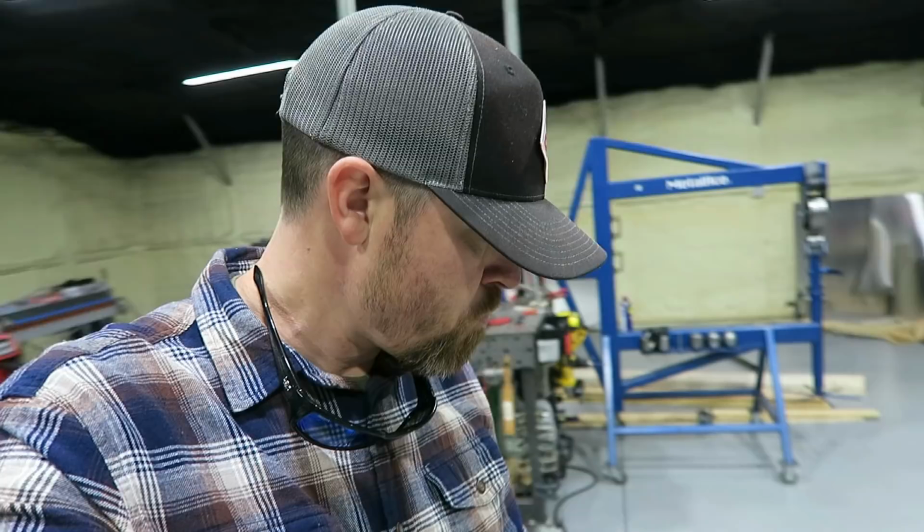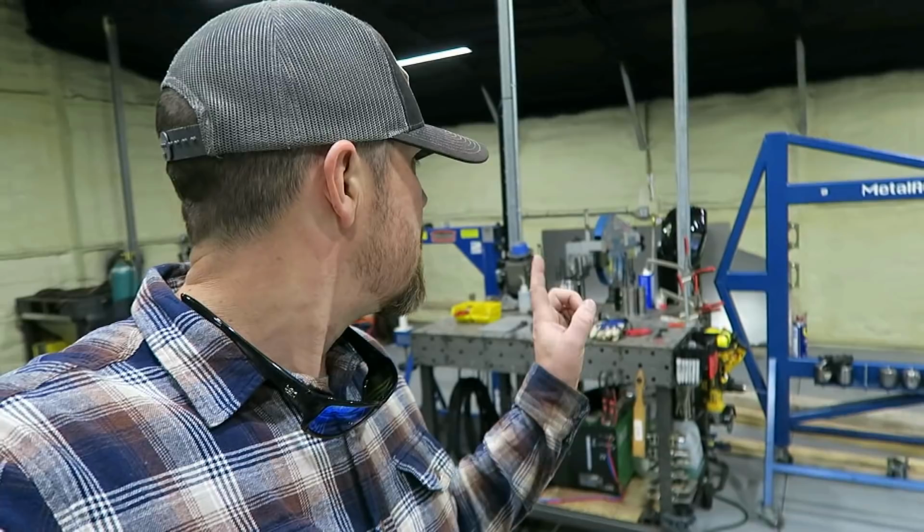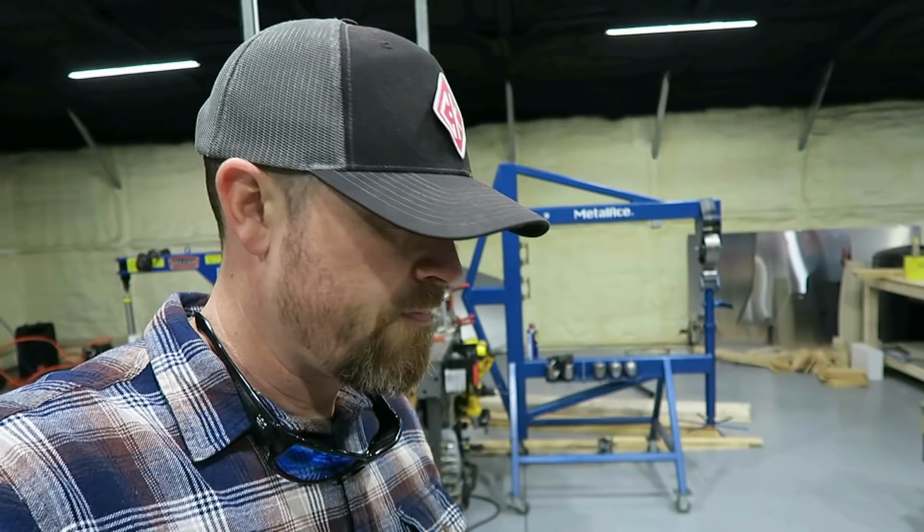Now I'll just trim it out and make sure that it has the shape that I want on the car. And then we'll just draw it on some sheet metal. Go ahead and knock two of those out. Go ahead and put the dimple dies in it. Get that edge broke. Probably use the tipping die on the bead roller. Kind of tip that thing over, shrink it a little bit, and we'll have a flange. A couple clecos, we can kind of see where we're at.